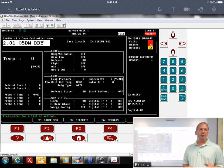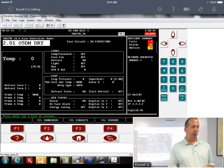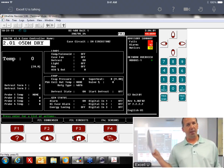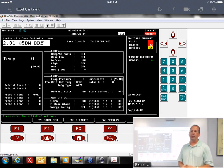So I think honestly, if you just left it and walked away from it, let's say it didn't load in PB6, so it wasn't reading your temperature, which means it's not going to do superheat. It's still going to control your case temp, and it will eventually get that parameter down there. But if you don't want to leave the store, start up morning, and you don't want to leave it like that, and you cannot get that parameter pushed down in there, you can actually set the parameter in this device too. That's the only thing that's not reading, my PB6, because we didn't get it in here. It's in here on how to do it, but you can actually program it into this device itself, and then it'll reside in there. But again, if you just walked away from it, it would fix itself eventually because it keeps pushing those parameters down in there. So it will get it in there at some point.